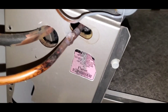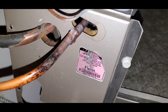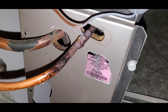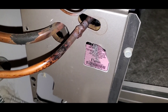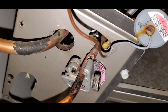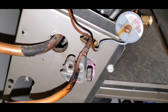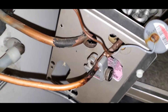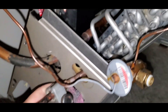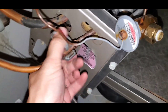Well, that didn't go as planned — the pipe broke, but that's okay. We're just going to cool it off, cut that, and put that new piece cut into the TXV valve. What I should have done was leave that fitting on and sweat this line out first — I guess I was nervous about the camera angle. I'm going to use a pipe cutter and cut the pipe here — it'll be a nice clean cut for the new TXV.